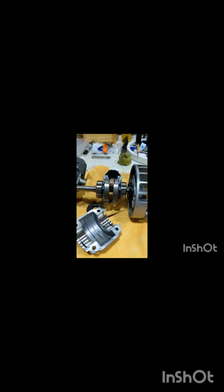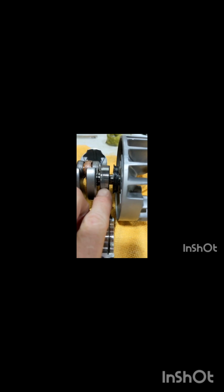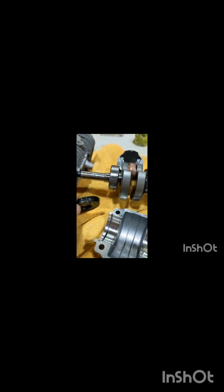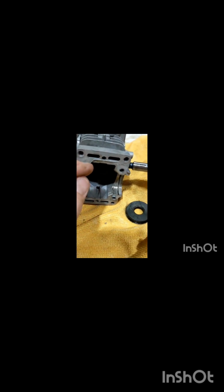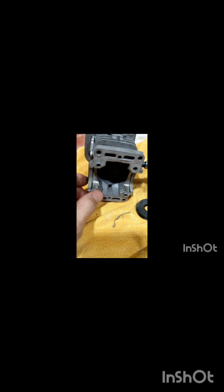I've had this little Echo probably about 5 months, and I just use it to cut and block small stuff. And it wouldn't start the other day, so I figured it was the compression. And when I poured some gasoline down into the crankcase and dumped it out, along comes some of these little gray particles of the gasket maker. So I'm just going to scrape all this off and reseal it, and it should be a pretty good saw